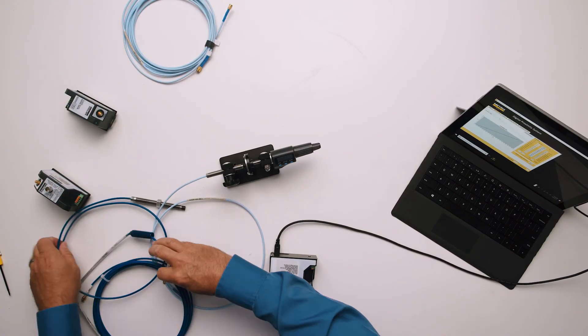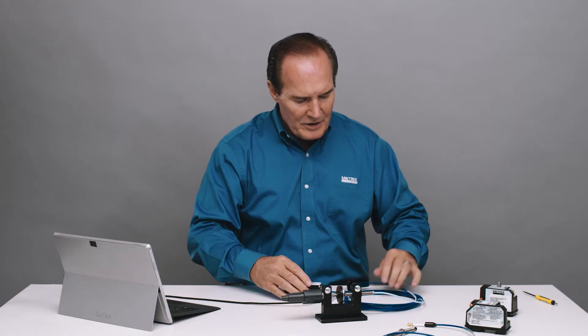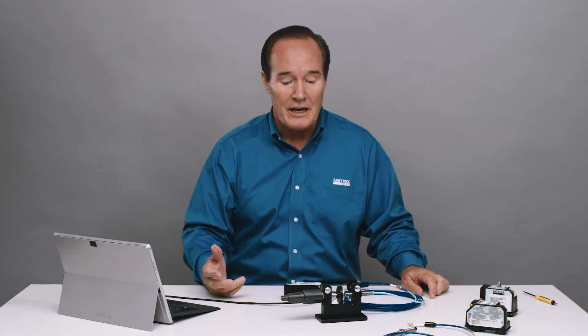Now we're going to try a mixed system. We're going to maintain the competitive probe and disconnect the extension cable and put in the Metrix extension cable. That will show that it works with a mixed system. Some people call that a Frankenstein system — mixed, unnatural. But when Mary Shelley wrote Frankenstein, that was a long time ago and things have changed drastically. It's natural to be able to put probes and cables together and have them work in the modern 21st century. We've changed out the extension cable and maintained the Bentley probe, and now we're going to run this curve again without changing anything inside the digital proximity system.